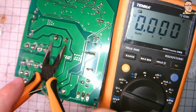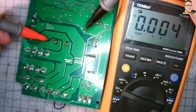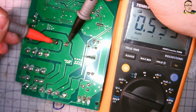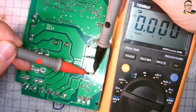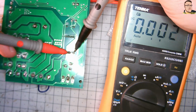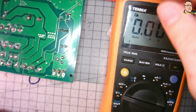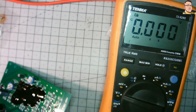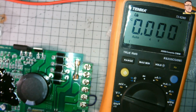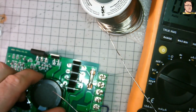Now I make the short, just to make sure, because if you see that it was slightly ramping up, maybe other capacitors kept some charge, but now there is no chance. But funny bit: this whole part is insulated, with a small transformer which insulates from the circuit, but the ground is the same. It means the negative from the capacitor is also connected to the negative on the potentiometer. It means still some way it is connected to the power.